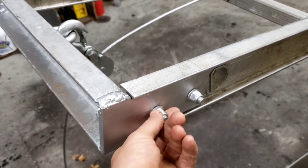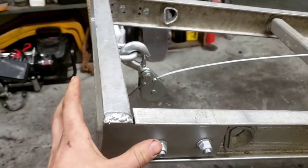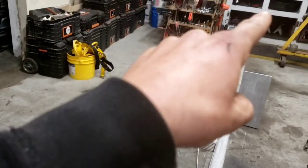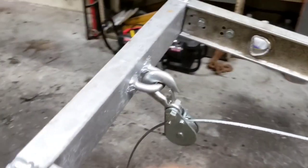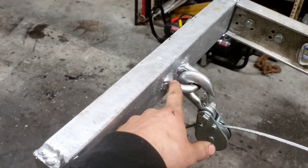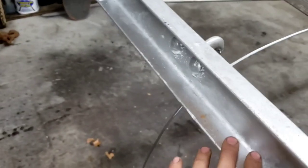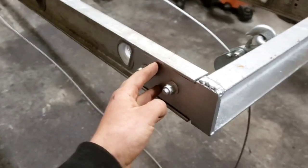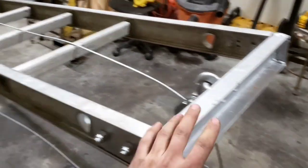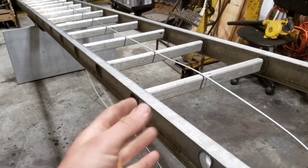I'm using nylon lock nuts — just nuts and bolts on the back side — nothing super fancy, but enough structure to withstand the pulling force running down to the motor. On the other end it runs to the basket. I used a high-strength steel U-bolt, but a shackle or pretty much anything that gets the hook through would suffice — it's just welded through to the back side with two holes drilled through. This is definitely going to be strong enough; I wouldn't bring this thing anywhere close to 500 pounds — maybe 350 at most.